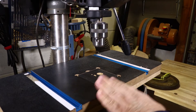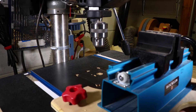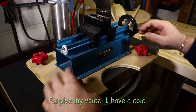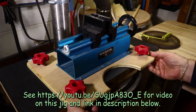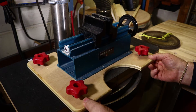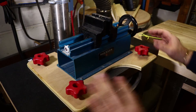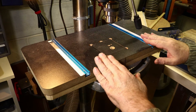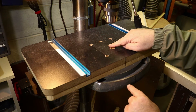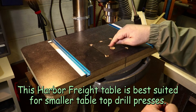Here's my $30 Harbor Freight drill press table. It's a little bit short, and when I put jigs on here such as this vertical drilling jig, I want to be able to slide this in enough where my drill bit centers on it — but I'm at a real close edge on the bottom side in the T-track where the bolts are very close to slipping out and not getting a good grip. So I'm going to build a bigger table that's wider so I can have more range with putting jigs on here. The reason the Harbor Freight table sits so far back is because that lines up center to my drill chuck, so I can center onto the replaceable backer.